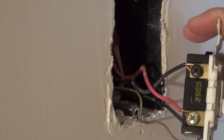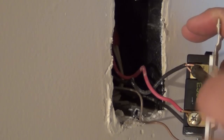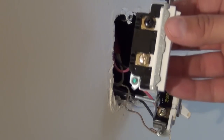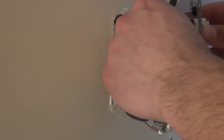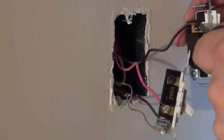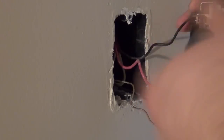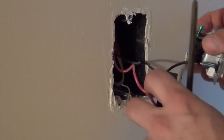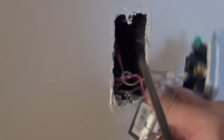What I usually do is take one wire off the old switch and immediately connect it to the new switch so there's no confusion. Let's go ahead and do that now — loosen the screw and pop this wire off. Get the new switch, here's the black screw, here's the wire we took off. Just slip it over the screw and tighten it — don't go crazy, just tight enough so the wire won't come off without breaking the switch. Then flip it over and connect the ground wire to the green screw ground terminal on the new switch.